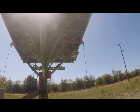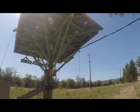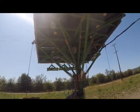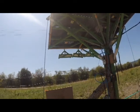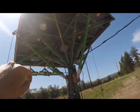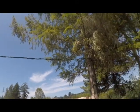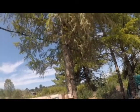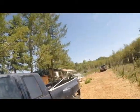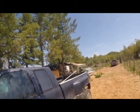I'm saving to drill a well and basically living on baloney and cereal and pasta mixes. But I'm not complaining — I'm glad I have the opportunity. All of the electrical: the three positioner panels dump into the batteries through the distributor — you can put eight in there but I only have seven now. The other six panels are jumpered together. Everything is grounded and meets electrical code. All the wires go across on that cable — taped and with a good strain relief so they won't get pulled. Right now they're underneath the bark on the ground, but eventually when I rebuild the roof I'll get all those wires up off the ground.